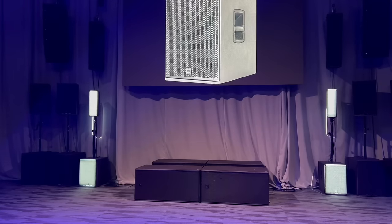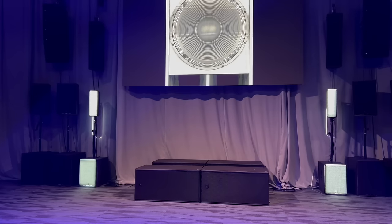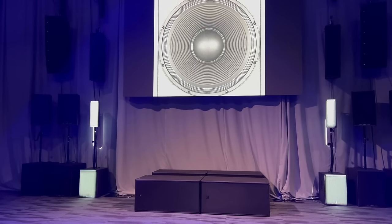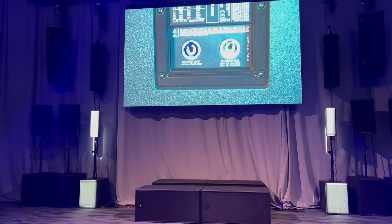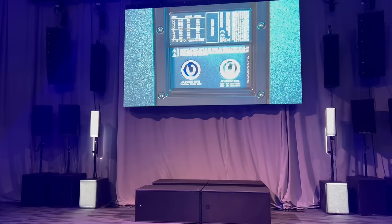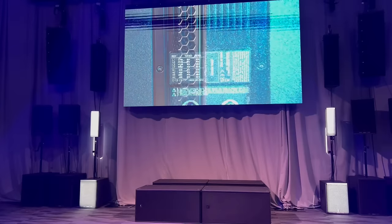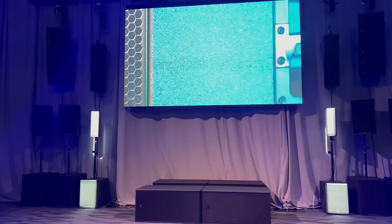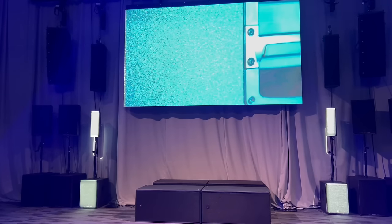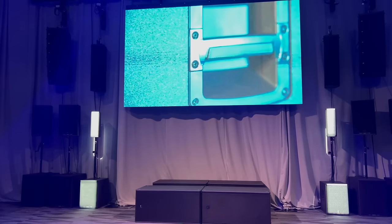The sub 905A MK3 is a self-powered extended low-frequency subwoofer with internal DSP. Its compact cabinet houses a state-of-the-art 15-inch transducer with a 3-inch voice coil, capable of producing down to 40 Hz with a max SPL of 133 decibels. This is by using a Class D amplifier generating 2200 watts of peak power. The newly designed all-wood cabinet is now treated with a tour-ready, scratch-resistant polyurea coating for demanding applications, desirable for music professionals in need of a compact, workhorse subwoofer.